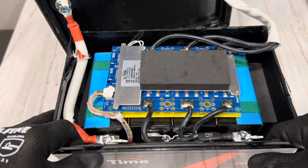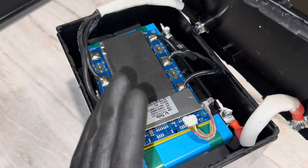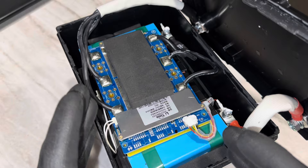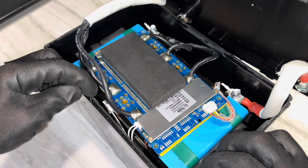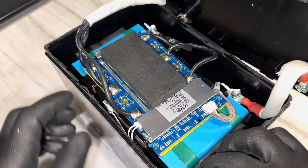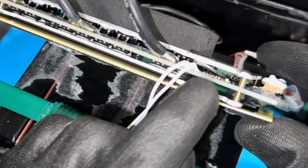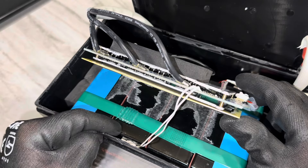There are no claims from LiTime for low-temp protection on this model. I pulled the BMS loose to check for high-temp protection on the BMS plus the cells. We've got a 75-degree C thermal switch right here — a pretty standard 75-degree switch protecting the cells from a high-temp condition. The BMS is mounted on an epoxy board on top of the cell pack, and there's a high-temp thermal switch on the BMS too — those white leads, little white switch right there. So there's high-temp thermal protection for both the BMS board and the cells of the battery pack.